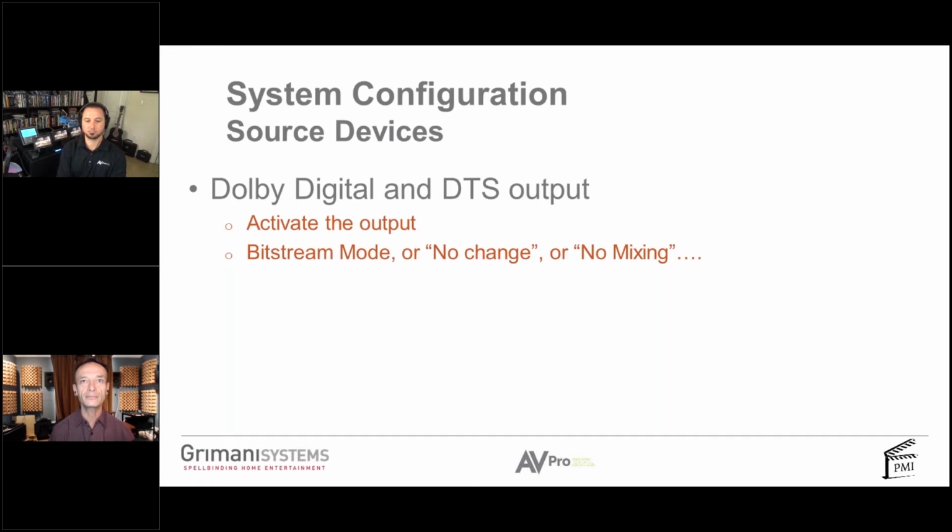If you have a more sophisticated system in which you have a bunch of source devices going into a matrix switcher, like the ones made by AVPro, you have to make sure that the EDIDs, the actual thing that talks to everybody, are all correct. If there are multiple outputs, one going to your surround processor and the other one going to basic TVs, the device could get fooled and turn everything into 2-channel because it's seeing the EDID of the TV that says, oh no, I can only take 2 channels. So it changes everything to 2-channel, including the main $1 million cinema.